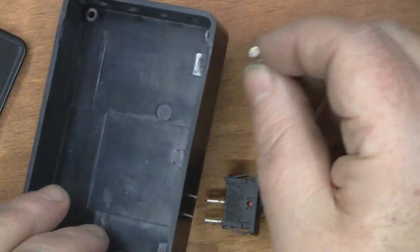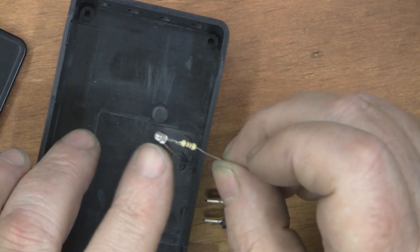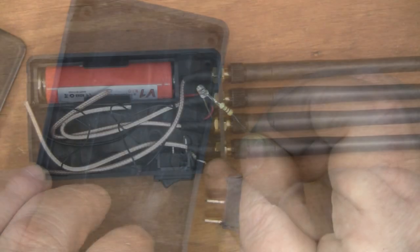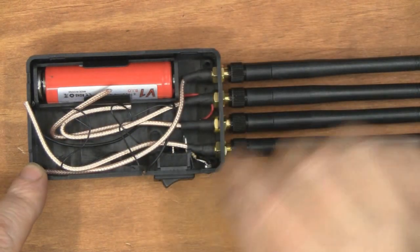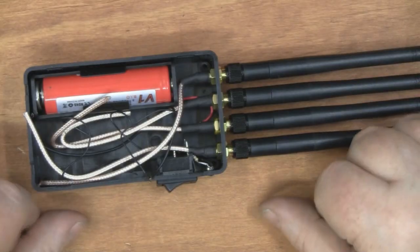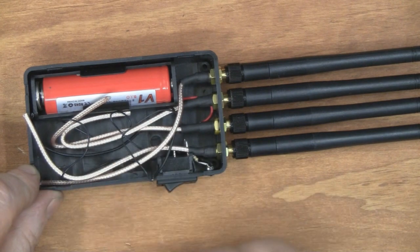I'm not going to put the LED in the top of the lid because I want this lid to actually come off so you can get in to swap the battery out and charge it up when it's depleted. Just above the rocker switch it should look okay. I've also put a little resistor on the positive leg — these very small LEDs only work on around 1.5 volts, so it just brings that voltage down so it doesn't pop the LED. So far everything is fitting in there quite nicely — battery in the holder, switch on the side, and the LED to show when it's powered on.